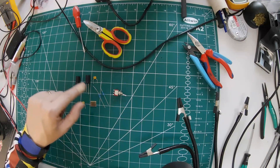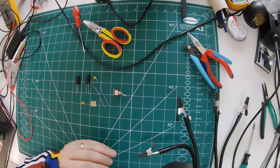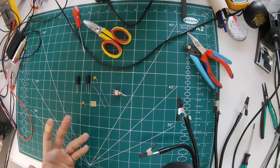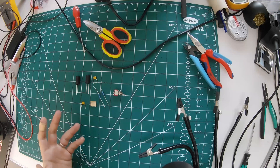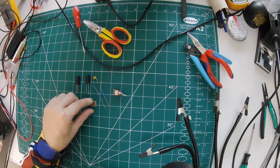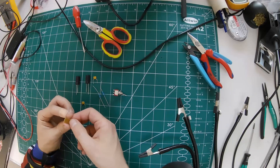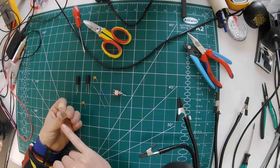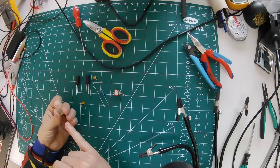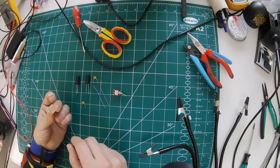Changing the value of the resistor will basically change the amount that this filter acts on the signal. Hopefully with these three components you get a nice balanced sound but without the big peak at 8kHz. We've had a little play around and this is a setup that we like, and obviously as it's switchable you can switch it off — it's not permanent. So if you're finding it a little bit too harsh you can switch that out, and on other tracks it'll probably sound good as normal. I've got a little bit of stripboard here and we're going to poke the components through — four rows, two for left and two for right — and the signal's going to come in, transfer through the components, and come back on another rail.